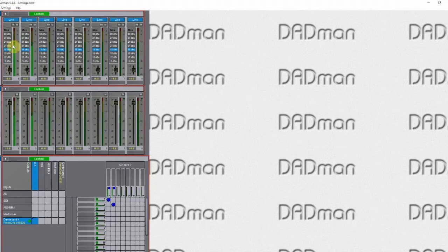In order to have 0 dB gain from an analog input to an analog output, it is important that you set the two levels, the output level here, to be the same as the input level. So if you have 18 dBu as maximum input level and 18 dBu as output level, you will have 0 dB gain through the system. So this is how you will set the analog input level. Make sure it matches the equipment that you're connected to. Check out the datasheet for that equipment and make sure that you adjust it so you avoid clipping in either end of a connection.